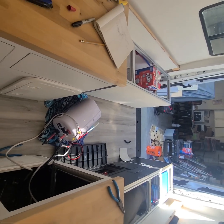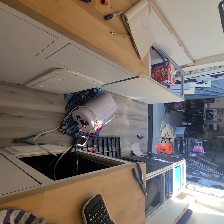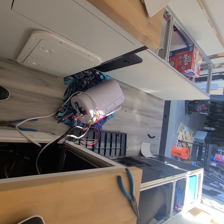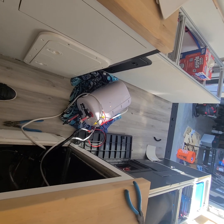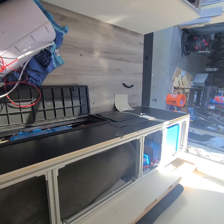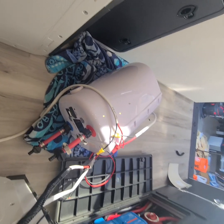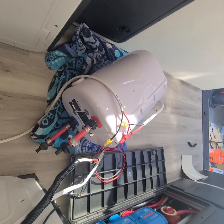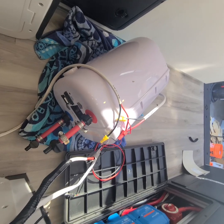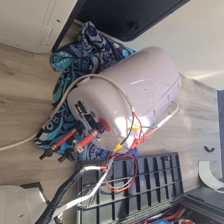If I turn it off by pulling them apart, that's off and the unit's off. Even though it's connected to the battery, it's not drawing any power. Some of the wiring you do in your van, like with the water pump, is a lot more straightforward, but this one you're actually connecting it to the battery at all times. The only time the relay is ever really enforced is when you have it switched on — which is to save your battery bank. That's really all there is. That took me way too much research and asking around to get comfortable with this.